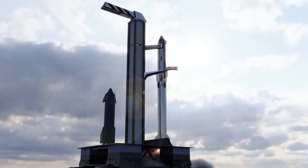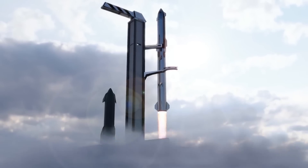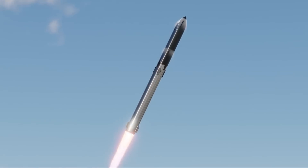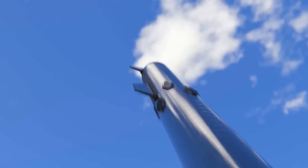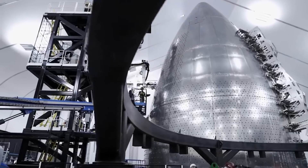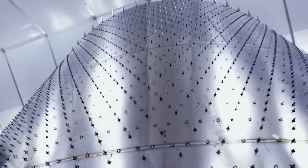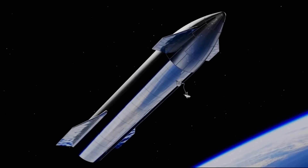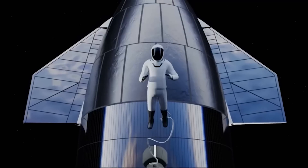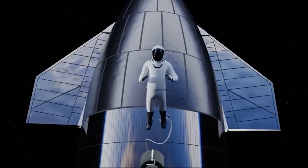The spirit behind SpaceX's new dome design appears to be very similar, presumably doubling down on the stretch-forming production method developed for nosecone gores. SpaceX appears to have also decided to increase the size of dome gores and reduce the number of stacked sections required for dome assembly, albeit from three to two instead of from five to two.